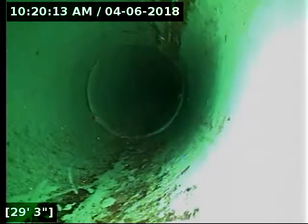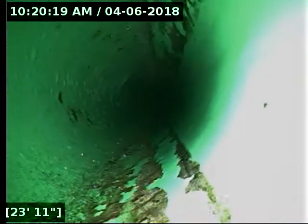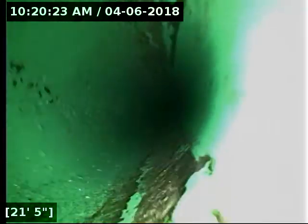Even if that rubber Fernco is still around the outside of that pipe joint, overlapping that joint by a couple inches and keeping it sealed off from water, a pipe joint like that with a backyard full of trees and soon-to-be large trees is very, very vulnerable to roots getting in. I'll bet if you wait about a year or two, you're probably going to have a huge root ball coming through that.